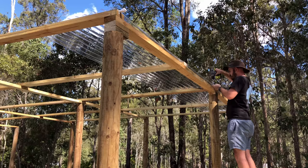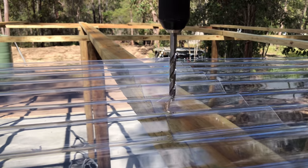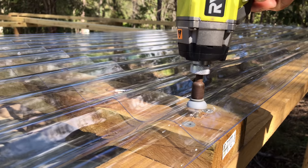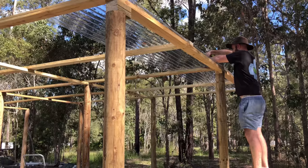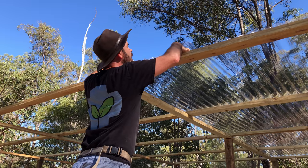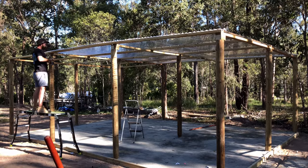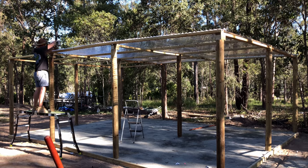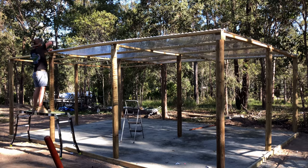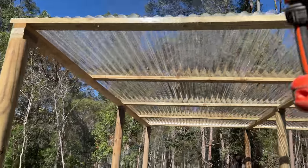Once I had the floor done, it's now time to install the roof. I was using polycarbonate panels which required a 10mm hole be drilled into the polycarb before screwing it down with the self-sealing roof screws. You can actually get screws that will drill the hole and screw it down, but they are poisonously expensive. I sealed all of the ends with specific foam made to seal for roof panel sheeting, so that I can insect-proof the entire roof once I have the side panels on as well. I didn't want insects finding their way underneath the corrugations in the roof panelling. The roof itself is just held together with batten screws joining each piece of timber.